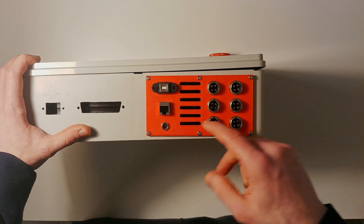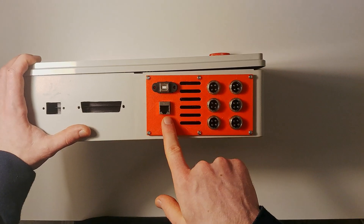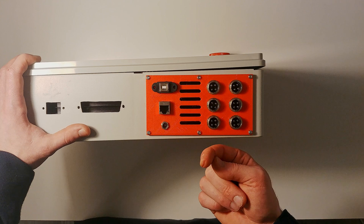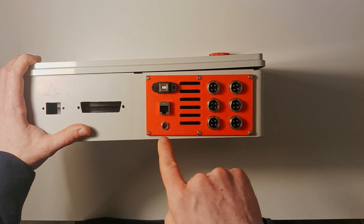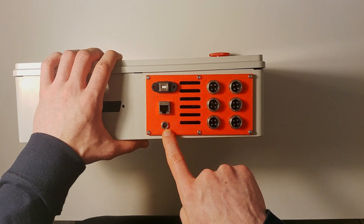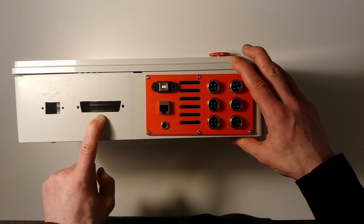Looking at the box from its side, there is a USB connector — this basically allows you to plug a USB-B connector to the outside of the box and it's routed to the Arduino on the inside. Underneath it there is an Ethernet cable connector used for incoming signals from the limit switches as well as the signal line for a single servo motor that could be used for a gripper. At the bottom we have a DC power block delivering five volts and providing power for all the limit switches and servo motors. On the other side of the ventilation holes that I printed are actually six GX16 connectors — earlier I tried to do everything through a single 50-pin connector, which turned out to be a bad idea.